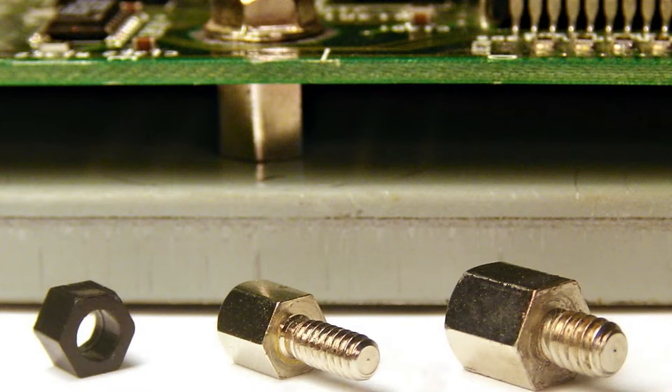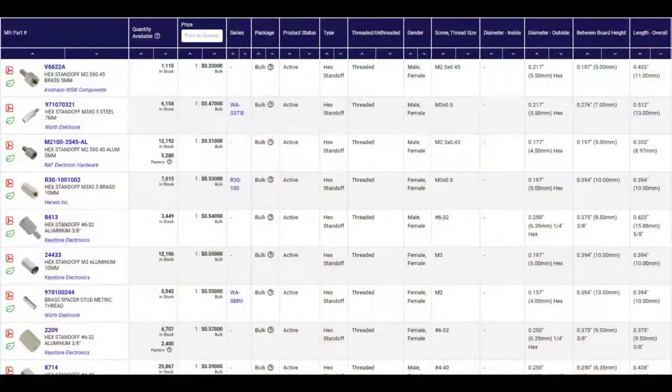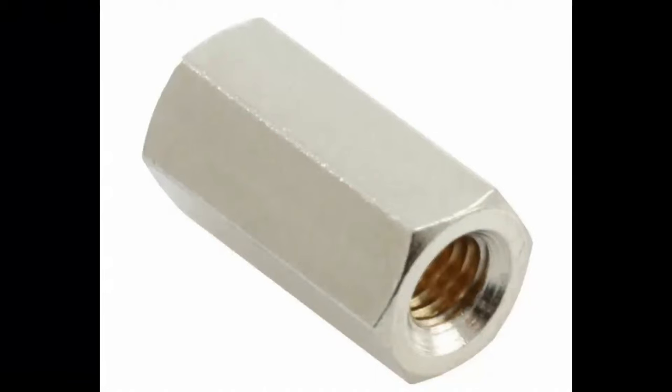You have to lift the board so that the buttons, potentiometers, rotary encoders, and TFT screen mount flush against whatever enclosure. Standoffs are great because you can get them in any thread, any size, any height, and then you just keep tweaking until you get the right height and standardize that on your kit. DigiKey has tons of them — tens of thousands of different styles available in steel, aluminum, nylon, even ceramics.